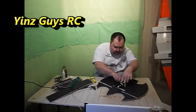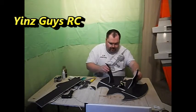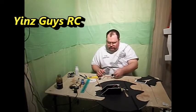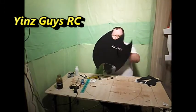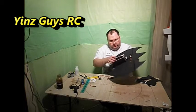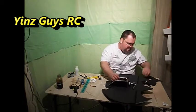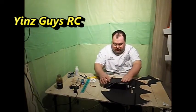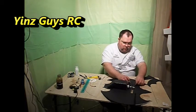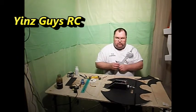For strength with hot glue, once you glue everything up squish it around a little bit, then hold it in place and you'll be good to go. We've got the sides of the pod built, the propeller in its cavity spinning. We're going to add some servos and a top to the pod. I already have the top cut out — it glues on top, hinged on the front and attached with a little bit of velcro. Then we'll look at where to put the servos and make the nacelles on the bottom.